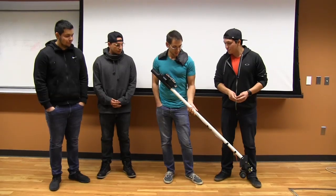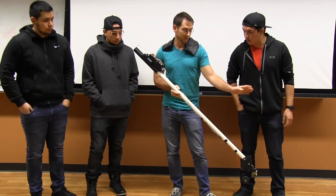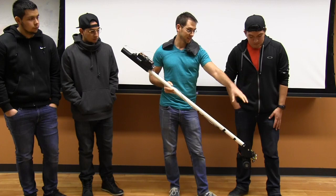We made a smart cane for visually impaired people. We have proximity sensors — sonic sensors in the bottom to detect objects in the front, left, and right that are in the user's path. We have a servo attached to some wheels at the bottom. The wheels aren't powered, but the servo controls the direction the user is headed in. If there is an object on the right, the proximity sensors will sense it and steer the user out of the path of the obstacle and back to the original path.